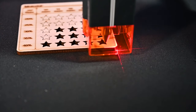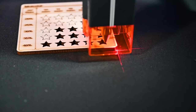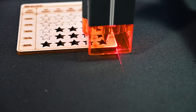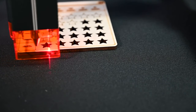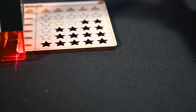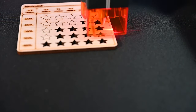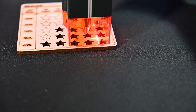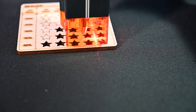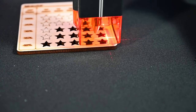Another aspect I really think is a positive — a feather in its cap — is the red dot crosshair pointer. It's really great to have something to line up your media before you engrave, and you can see that it is perpendicular and square to the gantry. Using the app, you can jog to make sure everything is lined up. And it does have an offset feature — if I tell the laser to start right where that crosshair is, when I actually start it, it moves over so the nozzle is actually in that position. Another positive aspect.